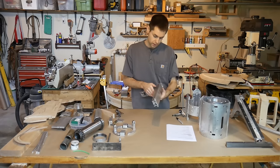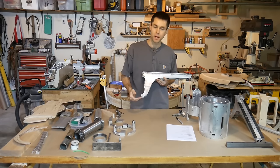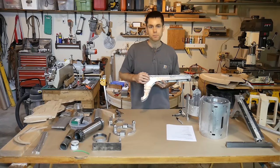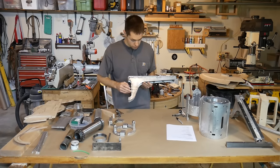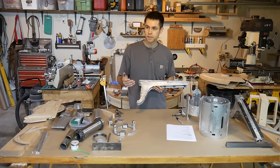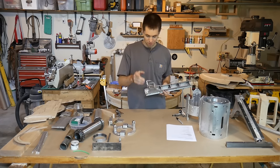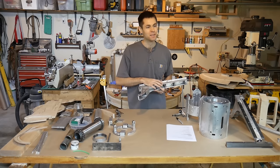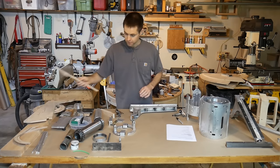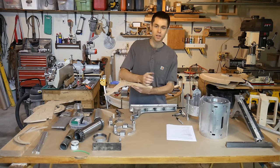The arm shape is an interesting thing because it started out with a basic piece like this, and I wanted to have the lowest mounting point possible to make it as strong as possible. I also had some curves because curves prevent stress concentrations. The problem is that you have to cut this out of a piece of material, and the widest pieces I could get my hands on easily were 6 inches, so I had to weld it together, which required a lap joint on the inside. It became enormously time consuming, and in order to make these shapes easier I came up with a template so that I could route around it, but trying to route around something thin like this causes a lot of wobble.